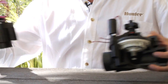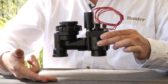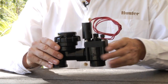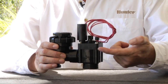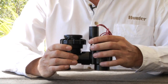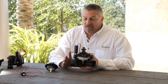You might also have something called the anti-siphon valve. This is not an inline valve that goes in a valve box, but it mounts above ground, usually about 16 inches off the grade. This happens to be a slip-joint style, but it works off the same premise. The front half is the anti-siphon portion, and the back half has the body, the diaphragm in between, the same flow control, and the same solenoid and manual bleeder screw. This is held down by four screws, and the larger ICV inline is held down by six screws. So that's the basic premise of how valves work.